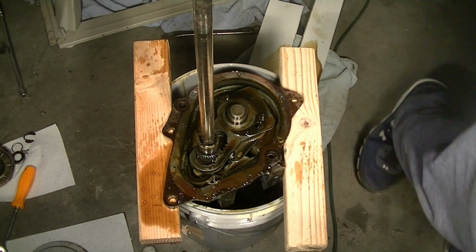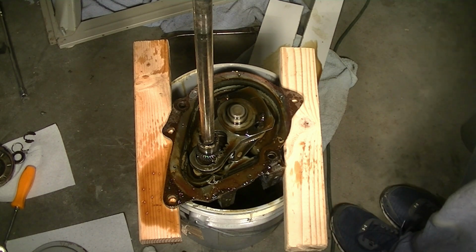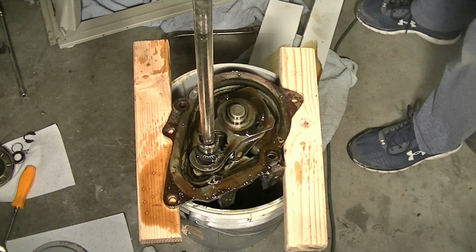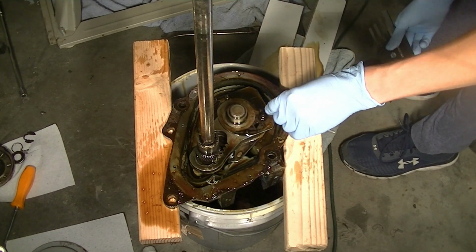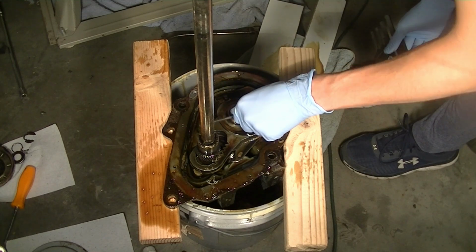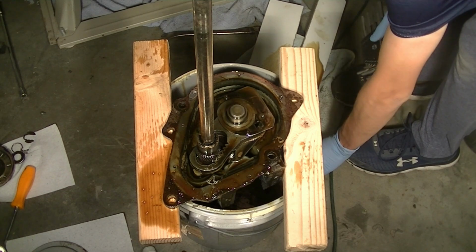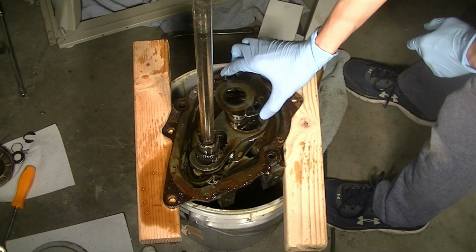I don't think we need to really change these, because the neutral drain, as you saw in the first part of the video when I tested it, still works absolutely flawlessly. And in fact, it doesn't even take that many strokes of agitation to get it to reset for neutral drain and hold in neutral drain without slipping into spin. I need to find the right size Allen key to remove this screw, which happens to be the first one I picked, so that's handy. I just have them sitting on a paper towel at the moment so that they're off the dirty ground at least. And this neutral drain plate should just pull right off like that,